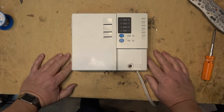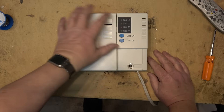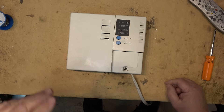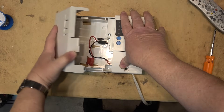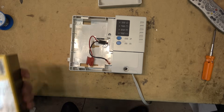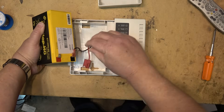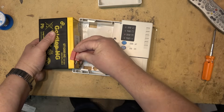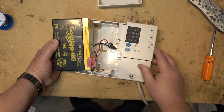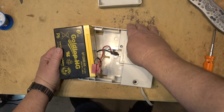This unit is dead. I'm told it goes into battery mode by itself — that's why it was taken out of service, because it started beeping even while plugged into power. There's no system power right now; it's dead. I'm told that if I give it a whack it might come on, but it won't stay on. The fault was that it was in battery mode when there was power applied. If I plug it in and press the cold start button it should turn on, but it's not turning on.